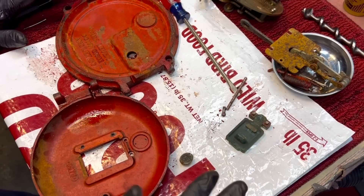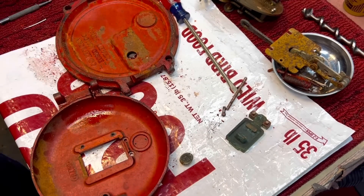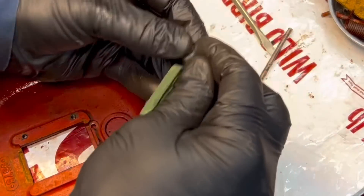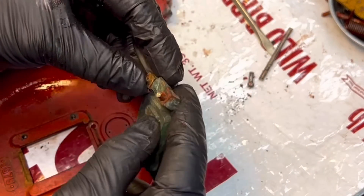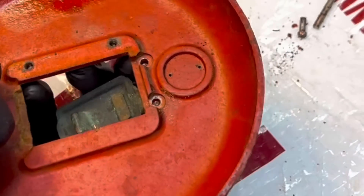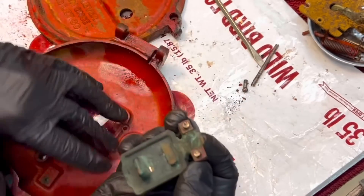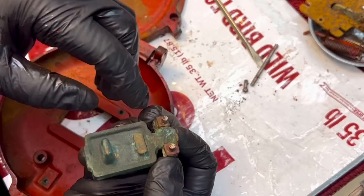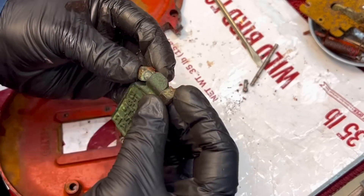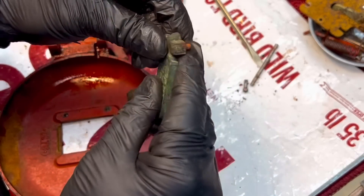If you've been doing restorations for a while, you'll always come across problems that in the beginning were huge obstacles, but after you've done it once or twice it becomes a nice, enjoyable challenge. This break glass little door was riveted — there was a tubular part that when it passed through, they would pound the tubes out. I can't paint around this, so I had to drill off the top parts so it comes off. I can drill and tap this and put brass screws in — that'll hold it on. If worse came to worst, I can always make this part; that's the beauty of having a lathe. So we have that piece sorted.